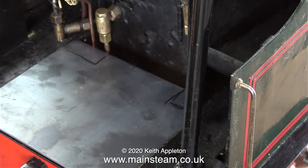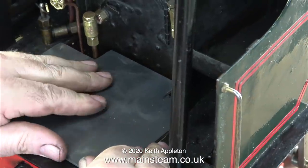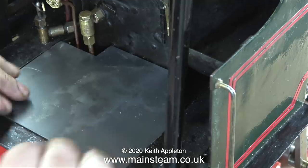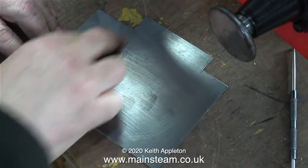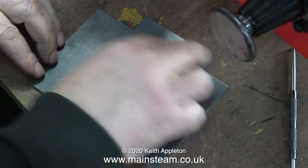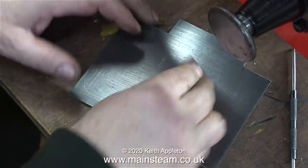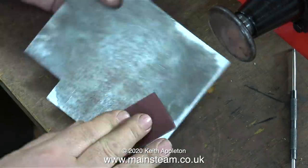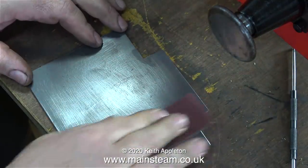I've marked out the positions where I'm going to cut the floor, so it's back over to the bandsaw to cut out these two pieces. Now it looks like this and it fits really well - it's a tight fit in the hole and snaps in place. The floor doesn't need any fixings to hold it in place because the right-hand side of it slides under the coal bunker. All I need to do now to finish the job is paint it, but before I do that, preparation is everything. In this clip at high speed I'm scoring the surface using some 100-grit emery cloth - by doing this the paint will stick firmly to it. If I painted the normally smooth surface of a piece of mild steel the paint would probably flake off over time. I'm scoring both sides because I'm going to paint both sides.